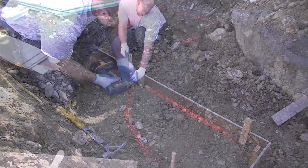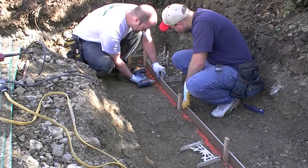Once the footings are dug, paint the line that represents the outside surface of the wall. Drive stakes every three feet. Fasten a bendable board to those stakes to hold your spider ties.